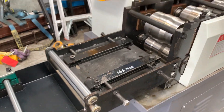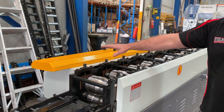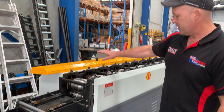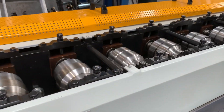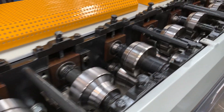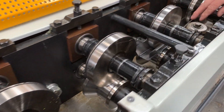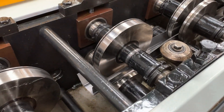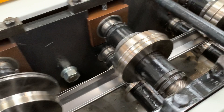And then we've got our heavy duty industrial 20-stage roll former. We've taken the covers off just to show you how this machine runs. As we go down the stages, the tooling basically forms your profile from a blank all the way through — once it starts profiling, there's your TDC profile halfway through the process getting formed up. And as you come down further and further, you can see the finished product coming out the end here.